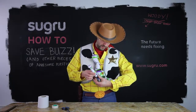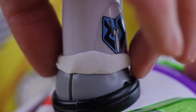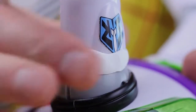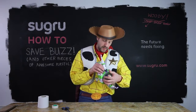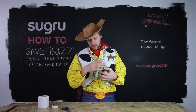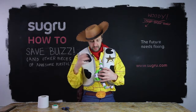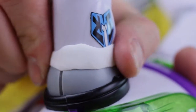Once that's done, press the Sugru against the plastics. You have two different parts of plastic — what you want to do is spread the Sugru over both of them. This will give you a good bond to both parts and hold it all together really, really well. If you don't know Sugru, it's perfect for this for several reasons: it will fill the gaps, and when it cures, it cures into a silicone rubber — a tough silicone rubber — so there's a little bit of flex in it, but it's also really tough and durable.